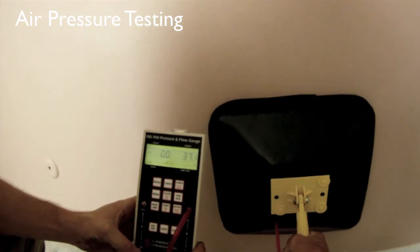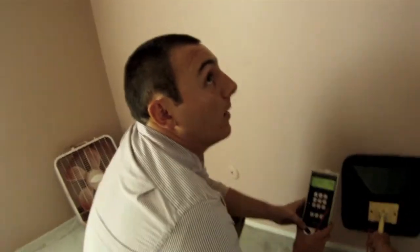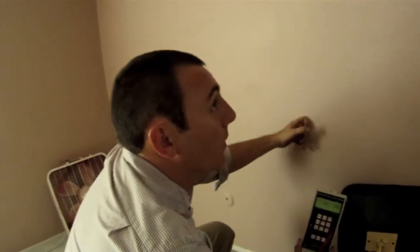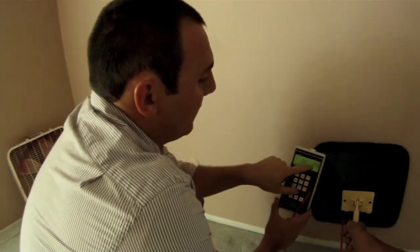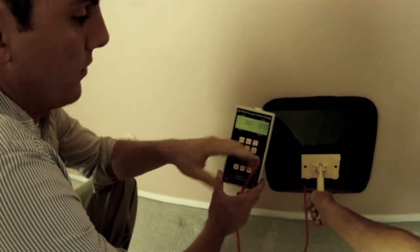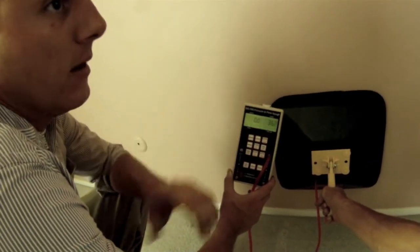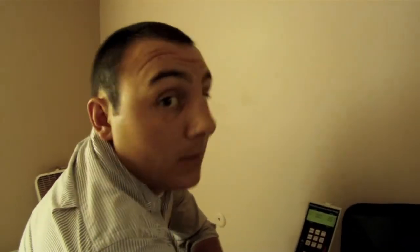When we check an outlet like this on an upper interior wall, it probably has some connectivity with the outside. Either it's an uncapped interior wall, which means it goes all the way to the attic, and that could be causing comfort issues as well. Anything over 40 is 100% connectivity. Anything between 10 and 40 is middle ground, but you can see how close we are to 40 here. This is showing me there's either an electrical penetration or just a top plate inadequacy where there's no top plate on top of this.